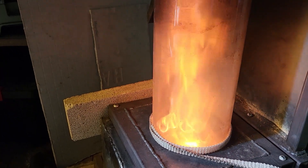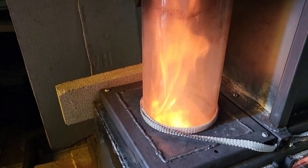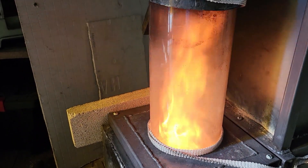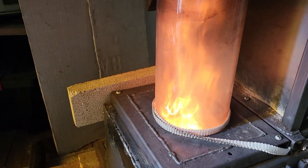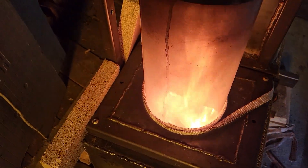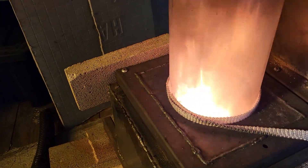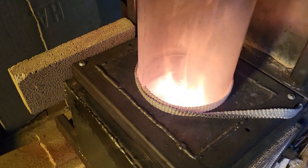You can see the tertiary burn working incredibly well. This is roughly what I'm after — a long slow burn, not a fast hot burn — with the damper just about all the way off. I just popped some fresh wood in and it burned very, very well until it started running out of fuel. Right now it's going ballistic with everything open — basically a blow torch. Let's see what happens when I slow it down.